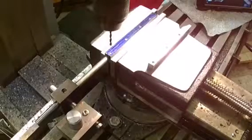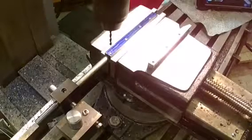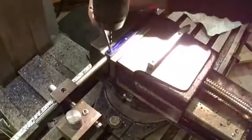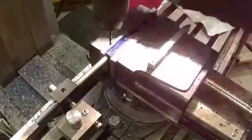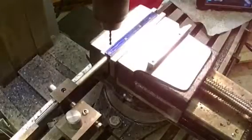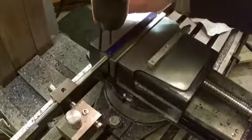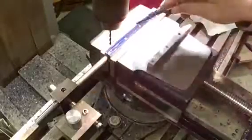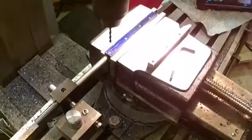Right, we're all set up in the mill now. I've got a DRO on this and we've got what's known as SDM function. What that means is I can set the coordinates for each one of these and save them, so no matter where I go and drive this mill around, wherever I go I can always come back to these holes. I've set this as SDM one — you can use a reference point at the corner of your vice as the first reference point, or it could be somewhere else if you wanted to. SDM one is there, so that's on the money.